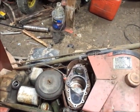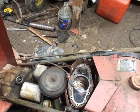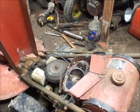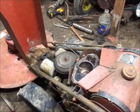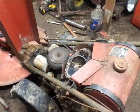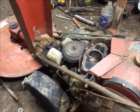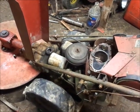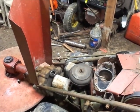Anyhow, Steve randomly remembering stuff he should have did, but didn't. So, oil draining. Oil in the cylinder, mag off, and then just put a little bit of gas in it and just go from there. If the gas runs out the bottom, we'll have to fix it. If it doesn't, try and get it to run. So here we go. Should be entertaining as always.